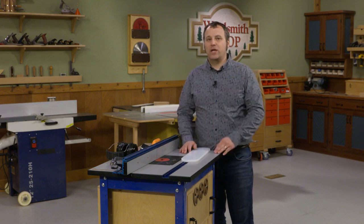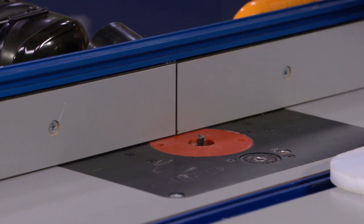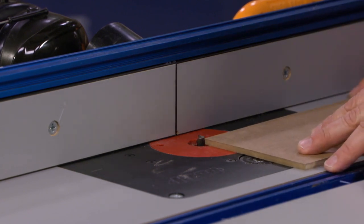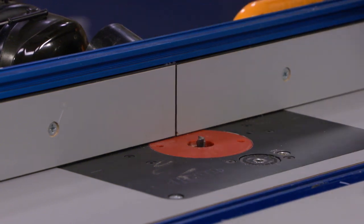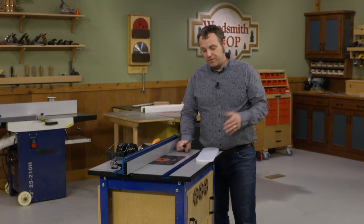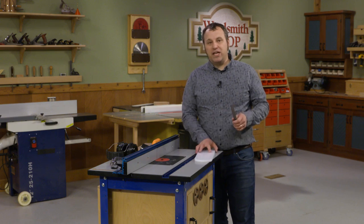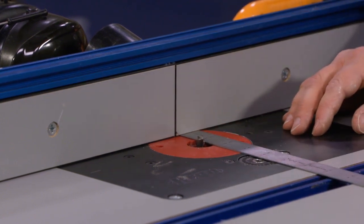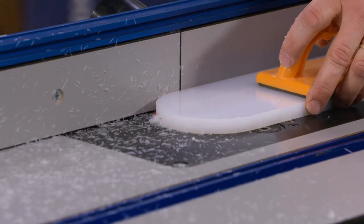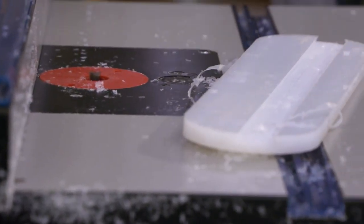Our blank is the right shape. The next step is to cut a channel in the upper face that's going to hold that replaceable strip. The shape of that channel is a dovetail, so we're going to use a dovetail bit here in the router table. The key thing is you want to make sure it's located in the right spot. What I did first is install the bit and set it to the thickness of the hardboard I'm going to use for that replaceable strip. Then you'll measure from one edge of the insert to the center of your table saw blade, take that dimension minus a half an inch — it's all in the plans — and use that to set the position of the fence on your router table. We'll make one pass at this fence setting, then shift the fence back slightly to create a wider channel, about an inch wide.